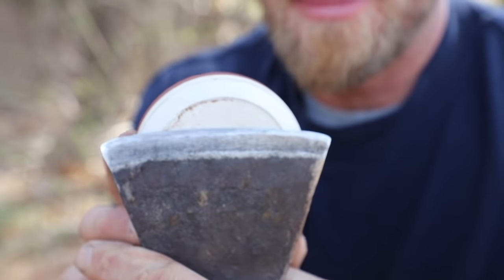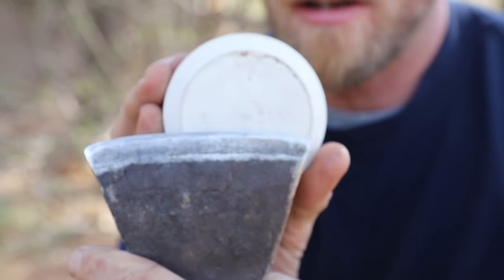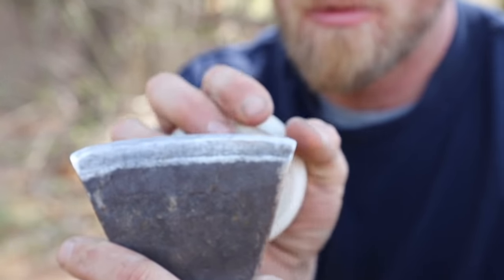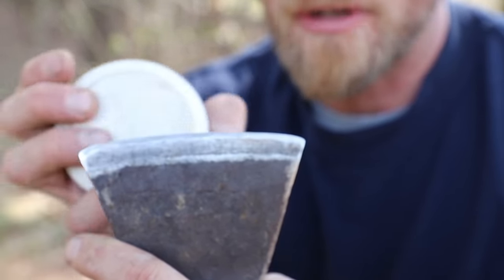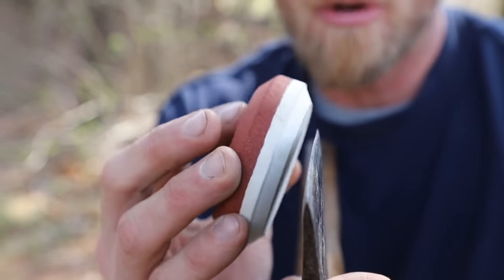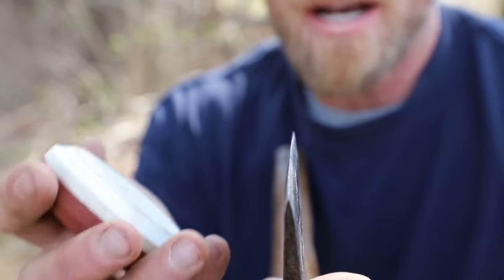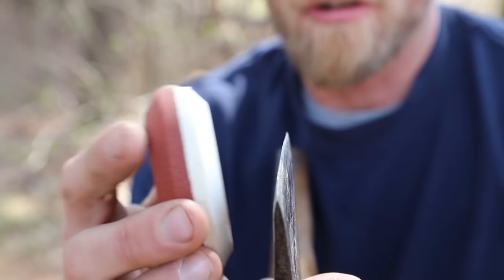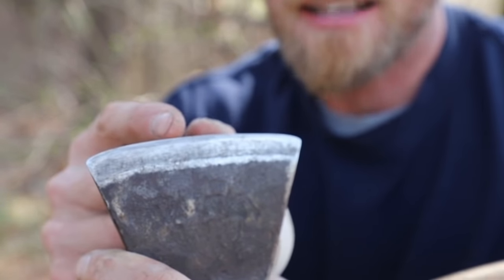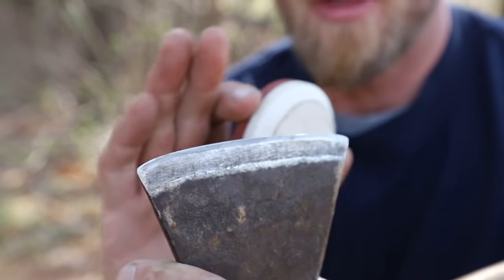What's important here is that when we think about sharpening the axe, we don't think about sharpening the whole bit at once. We want to break it down into small little segments. That's going to allow us to continuously adjust this stone in and out as we go along. Our bit should be straight, of course, but we as humans are going to have some error, so if we focus on small sections down the axe edge and make sure we keep that gap closed, all the better.